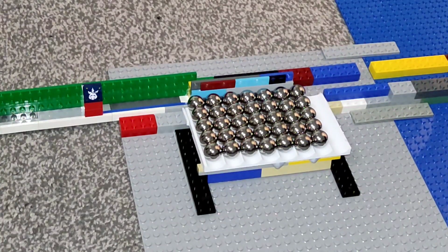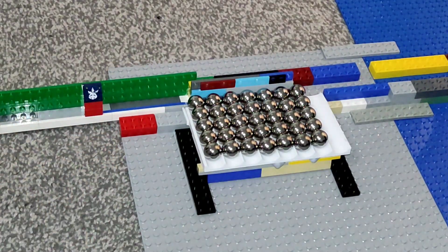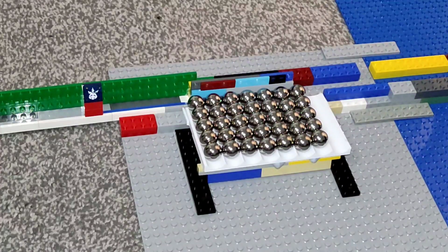So at maximum speed, we're expecting the Marble Machine XT to be able to do roughly 200 beats per minute, which is really, really fast. And at its current rate of 8 marbles per beat, that's like 1600 marbles per minute, or if you do the maths, about 27 marbles per second, which is a lot, right? But we've just shown that this can theoretically do between 20 and 25 marbles in this amount of pockets. So if we push this through in a second and it does manage to pick those up, that's roughly what we need for the maximum scenario. Obviously this thing will be going all the time, so we don't expect to play 8 marbles per beat continuously, but if we did, this would have to be able to keep up.